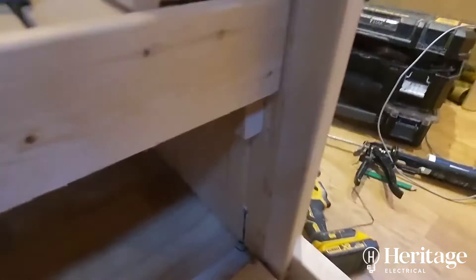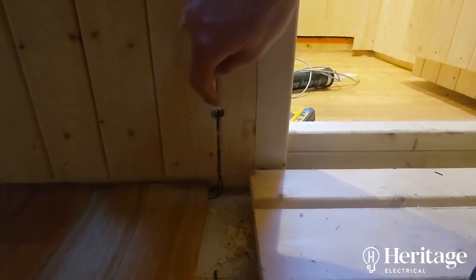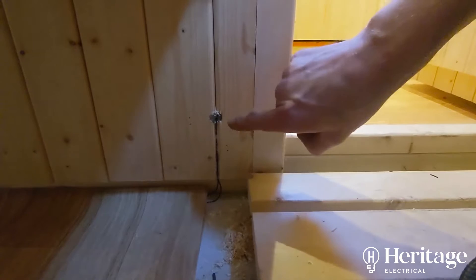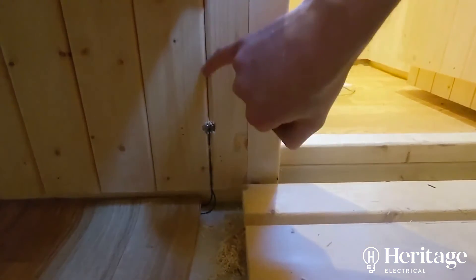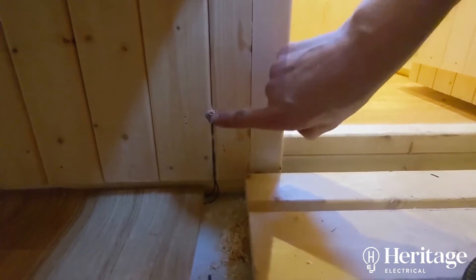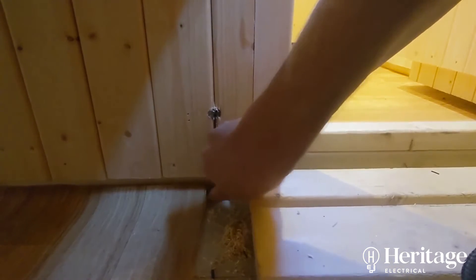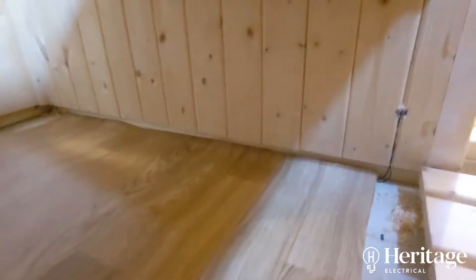There's the door sensor. Just drilled through with a flat wood bit so I could get the cable through and out at that angle. A slight cut using the multi-tool into the timber. Tuck the cable in very carefully and then just some sealant there — that's just going to hold that cable in place, just a little bit of slack on it. And then it just goes underneath this lino all the way along and pops through.